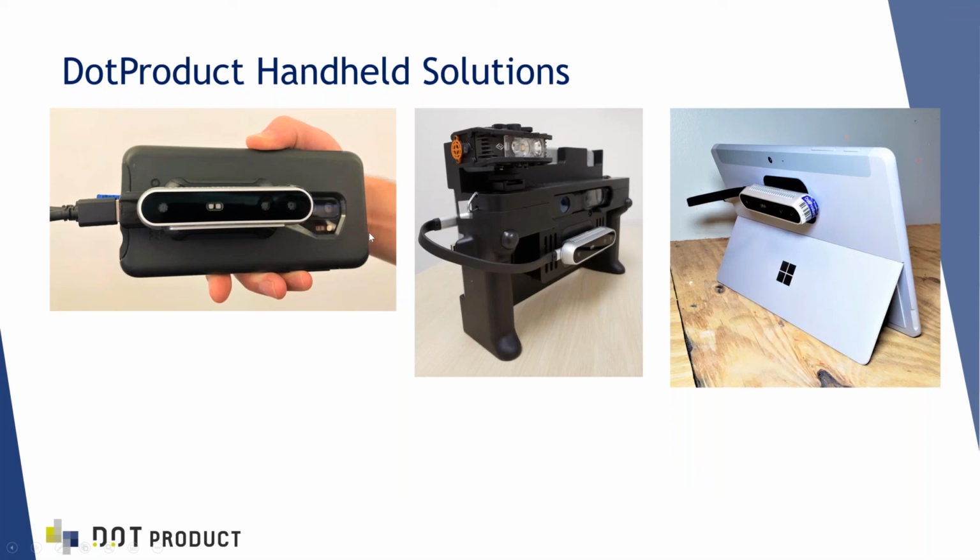We provide a variety of 3D scanning solutions. This is a phone and a RealSense camera. The one we used on this project was a DPI-10 scanner with a light kit. That's the one in the middle. They come in various shapes and forms, but this is the one that we use. The DPI-10 has a Carmine short-range sensor on it. It's ideal for this kind of project.